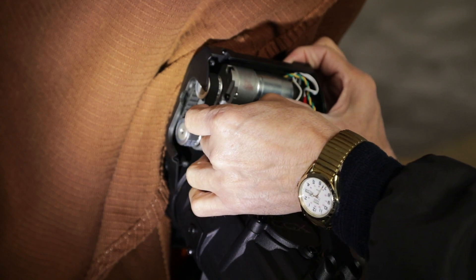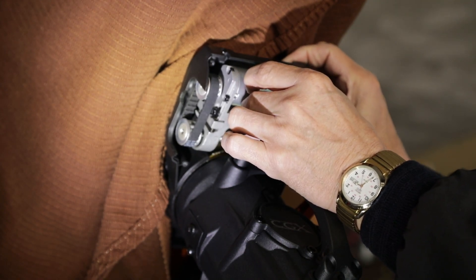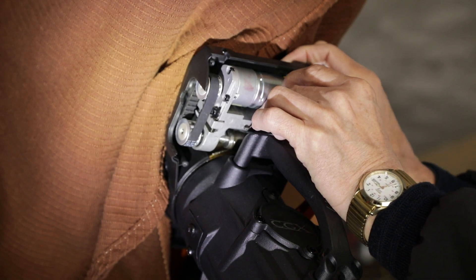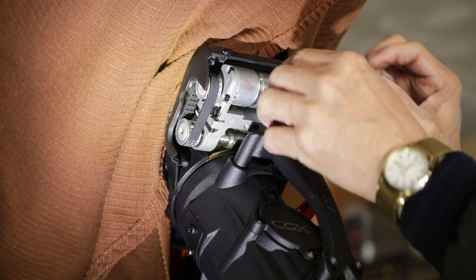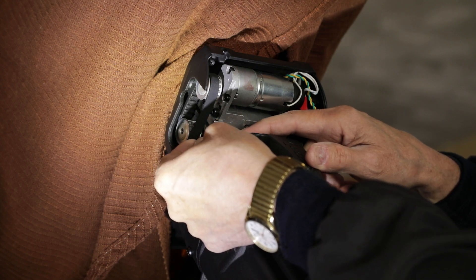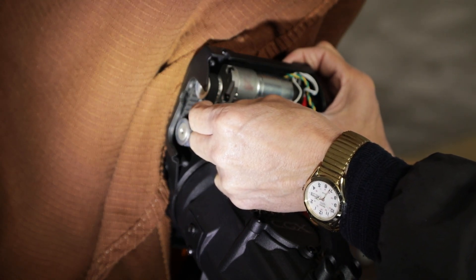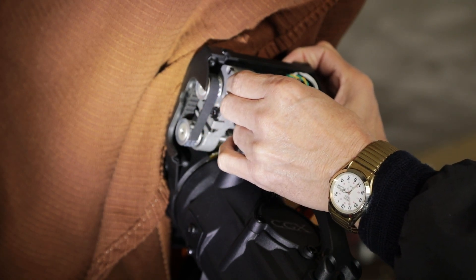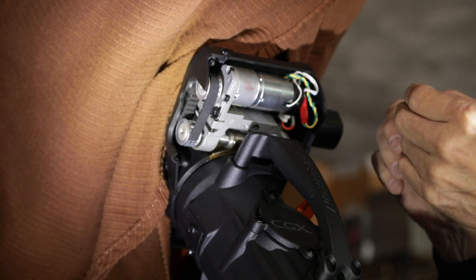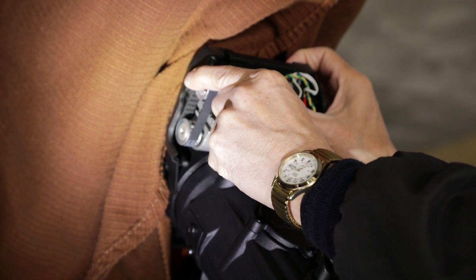How we do that is with the two millimeter Allen head screw. We just want to watch the travel as we're tightening the screw while jiggling up and down. We're getting close — that's perfect. So now I have my two millimeters, maybe a little more.